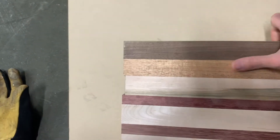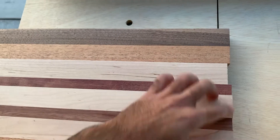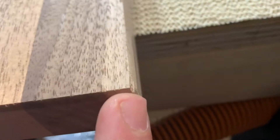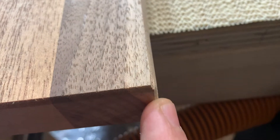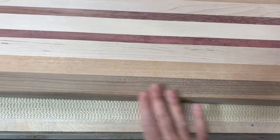So the next step is to trim the edges. I have a video on this jig — it's pretty square, just pieces of plywood with a hole cut out in the middle. We'll take just enough to get that gap off, then flip it over with the same edge along the back fence. Using the round-over bit, I rounded the edges. I kept going thinking I could get a little better and got a little bit of tear-out there, but overall pretty good — nothing some sanding can't fix. Went from 120, 220, and then a little bit of 320 and 400.